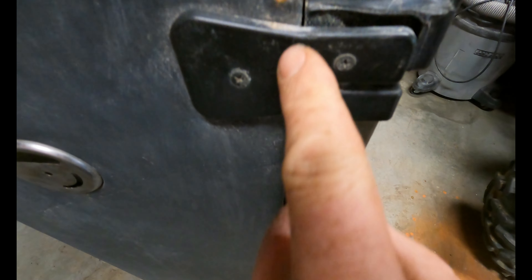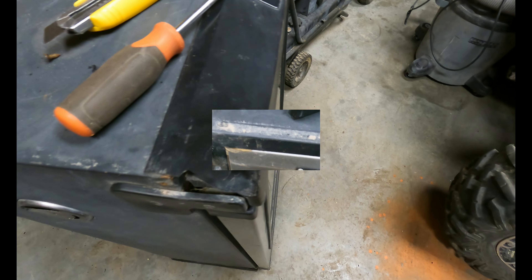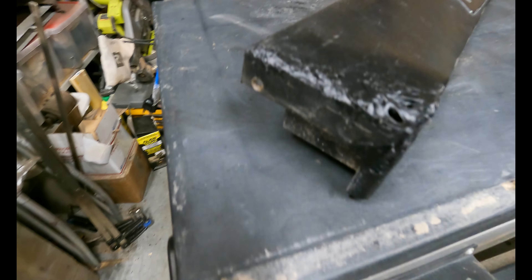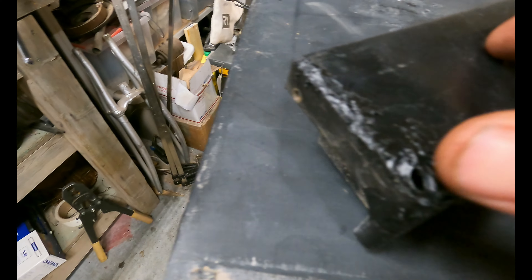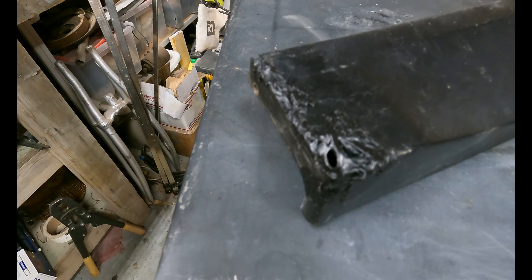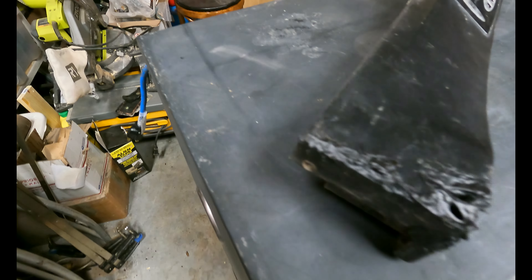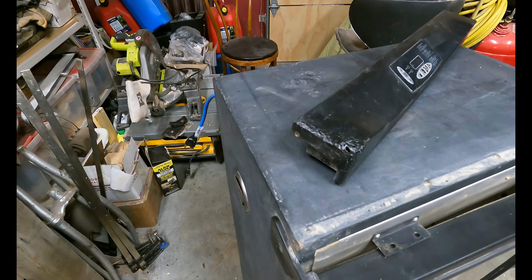Backed the little screw in to hold the piece I cut, then put the epoxy on. This is the first coat — webbed it across the bigger gaps. Now I'll fill in the smaller ones, smooth it out and give it a sand.